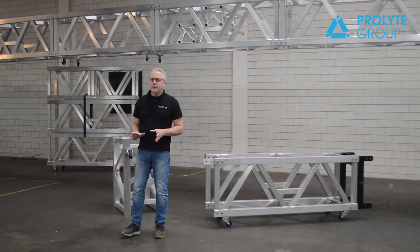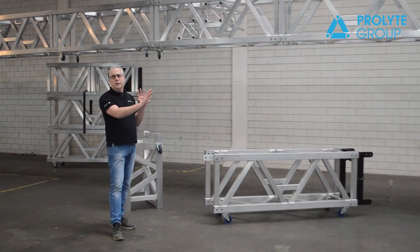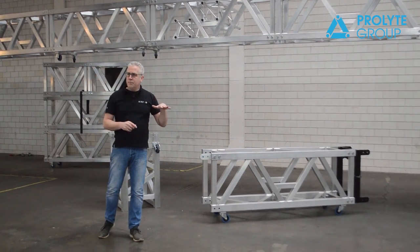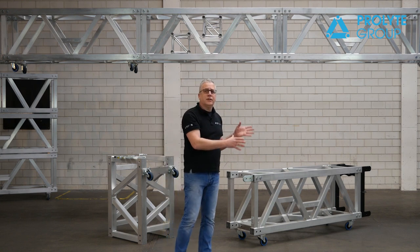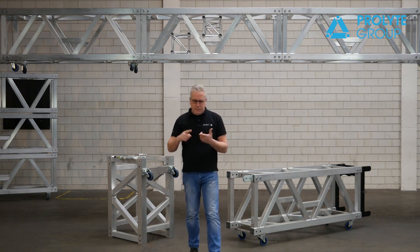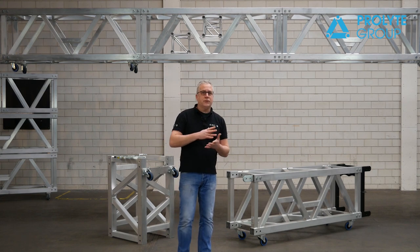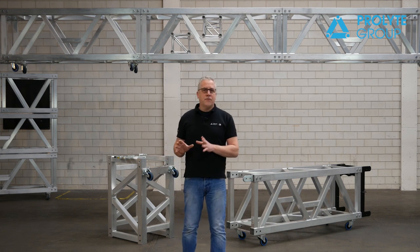What is pre-cambering the truss? Pre-cambering means you bring a pre-tension into your truss — the connector in the top cord is longer than in the bottom cord. So once your load is added to the truss, your deflection will finally be zero, giving you a completely straight line. Depending on the size and load of the span, you can choose which spacer to add: 2mm, 3mm, or 4mm. We have all those loading data available.